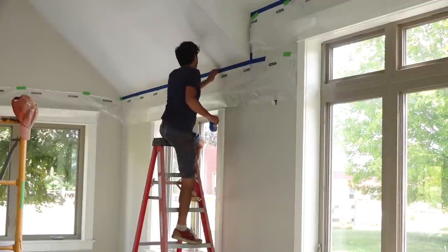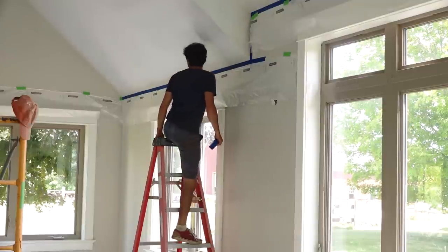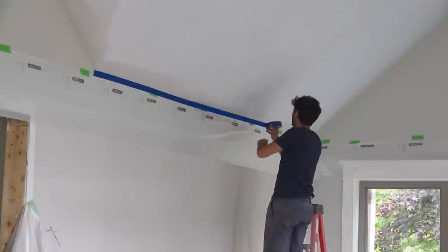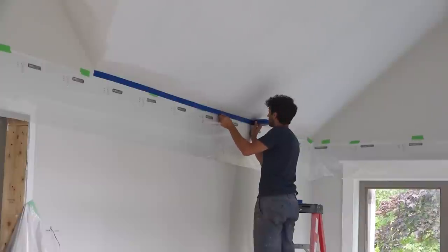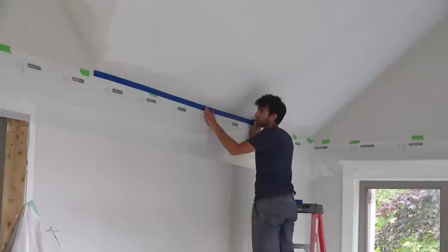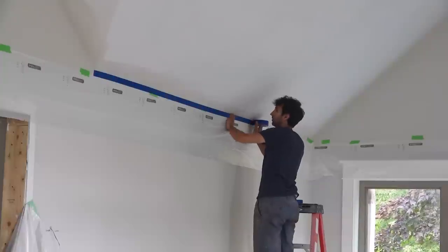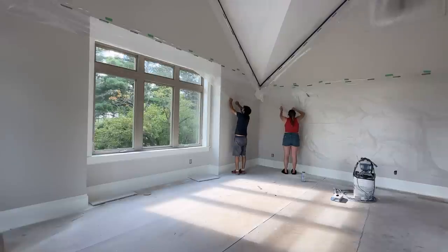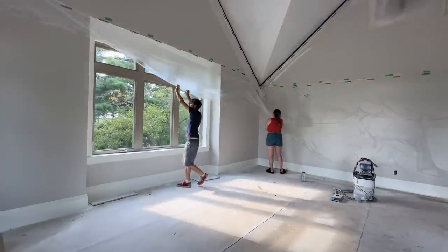So along the wall, I'll be able to mask off a straight line or a straighter line than what is there right now. That line probably will deviate between being technically on the ceiling versus the wall, but it'll be straighter. So it should help me mask some of the waviness that exists where the wall transitions up into the slopes. The other area that has even worse seams is at the very top where the ceiling meets those slopes. Those are literally all over the place, curved over the length, S-curved and C-curved, and it's a lot. So to help combat that, this room used to be a three-tone paint job.